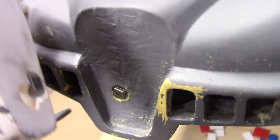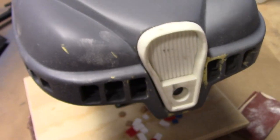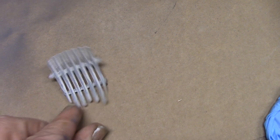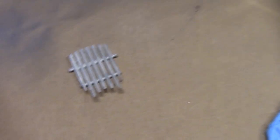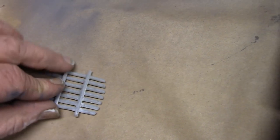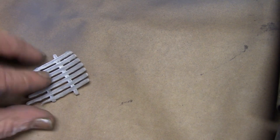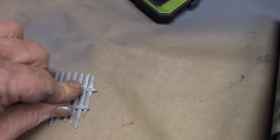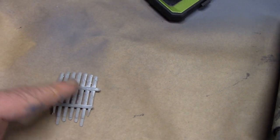Magnet — stays right in place. This is the grill — it's a 3D printed part. These bend a little bit sometimes; it might be this particular resin I'm using. So if you have a bent piece, grab a heat gun. This 3D printed resin is very pliable with heat, so I'm just going to press that down flat.